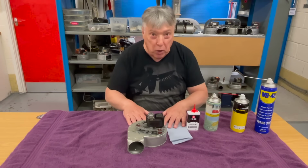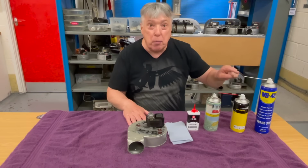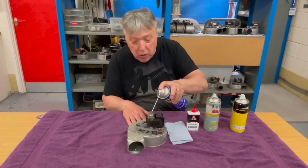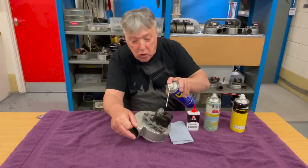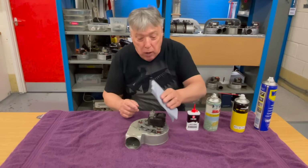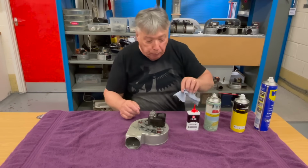So the first thing we can do is use our WD-40 because it's a brilliant degreaser. So we can get a can of this and just put a few drops around here and then very carefully on the bottom bearings, just a little bit here and a little bit there, nothing huge, and then with a paper towel, just gently mop it up here and mop it up there.